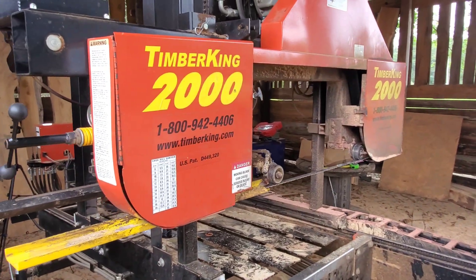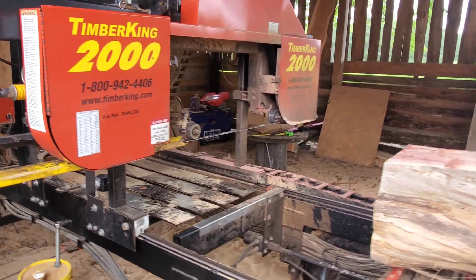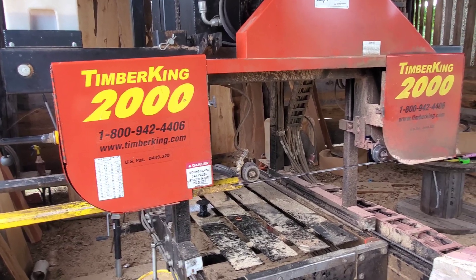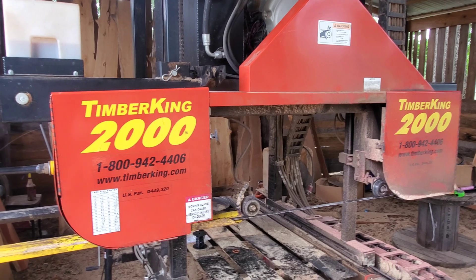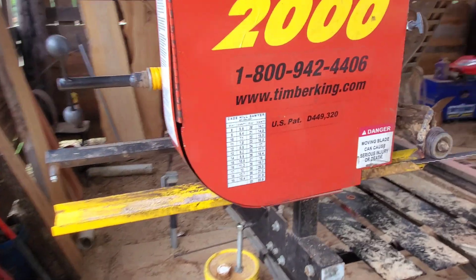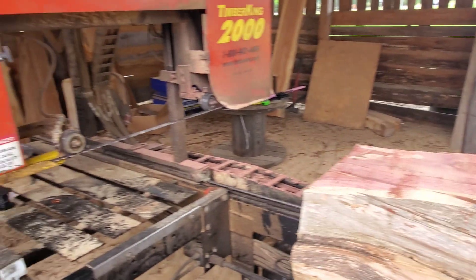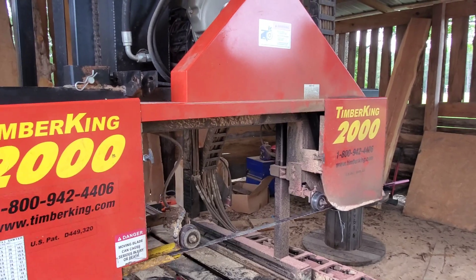I also have another valve I want to try. The solenoid valve, over time as it holds open, will get some heat buildup — there have been discussions about longevity. I also have a mechanical ball valve I want to try, and I might install that in the next mill. My buddy is also going to put together a kit with all the pieces and parts — three-eighths inch barb hose and everything — so if something goes wrong with the solenoid it doesn't leave you high and dry; you can bypass and run water manually. There are a few other upgrades coming for the sawmill, including a laser my dad has on his mill. Please like and subscribe — thanks!